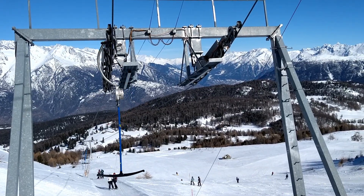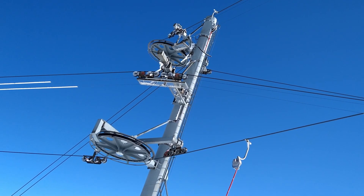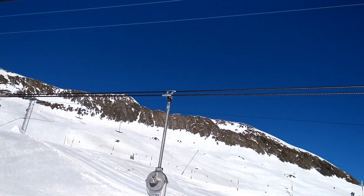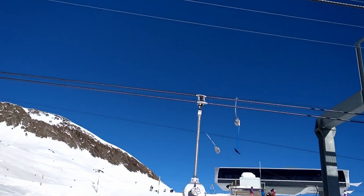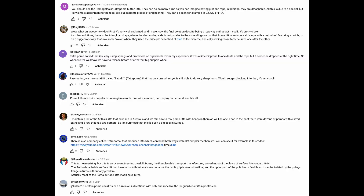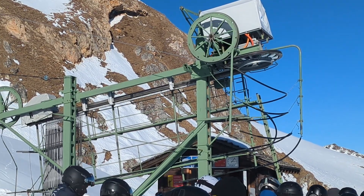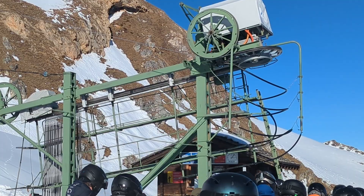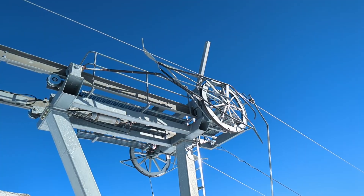The three solutions were: keeping the deflection minimal by making only tiny turns; adding an extra loop on the way down to deflect only in one direction; and the most powerful one, adding an extra rope to rotate the grip away from the pulley. I've gotten so many comments suggesting another, much more brute force solution to the impossible ski lift problem — installing guide rails that simply slam the grip wherever you need it to go. This is how the famous POMA lifts do it.